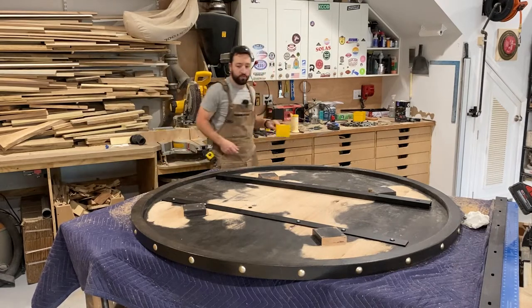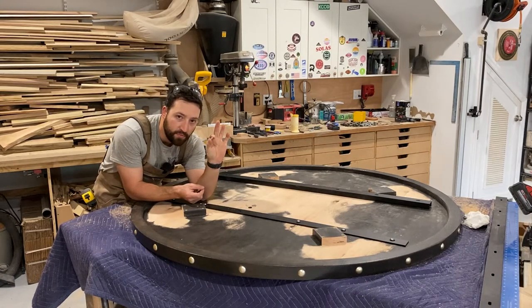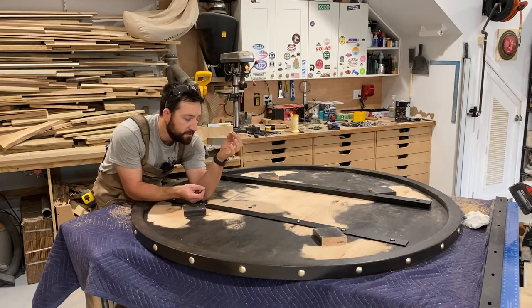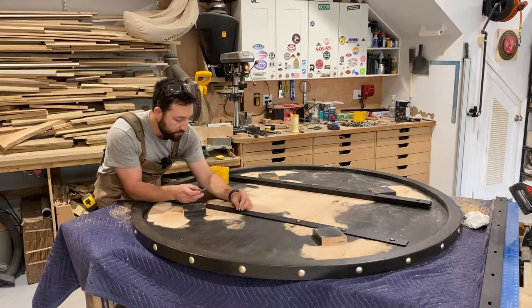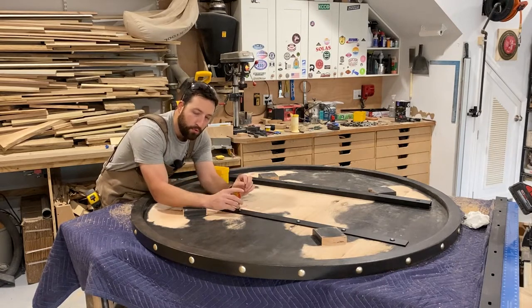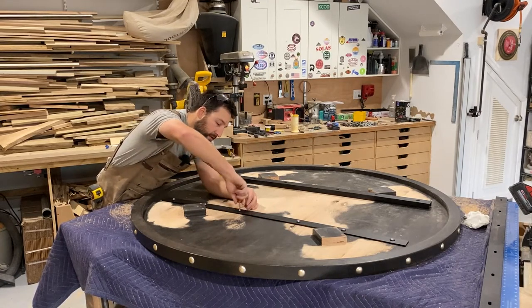Now, they make multiple sizes of these, but this is just one that I've found that works good. It's a 3/4 inch deep embedded anchor that you just have to drill a single 3/8 inch hole, and you can set it in with wood glue, you can set it in with epoxy, you can set it in with, you know, CA glue, whatever you choose, just something to keep it from moving and cracking loose when you're tightening or torquing something down into it. So they work really good.